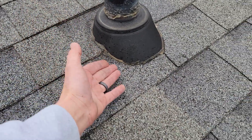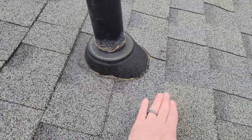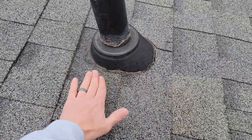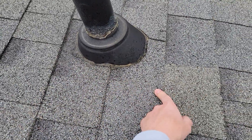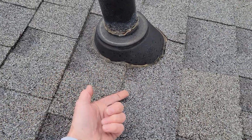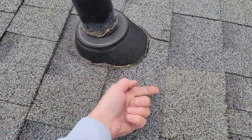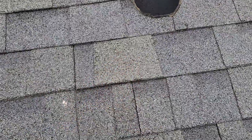So water running downhill is on your pipe boot flashing and whatever is on either side runs out on top of a shingle. You've got to use your own judgment on where you actually break it. If you go under too far, part of your boot is going to be exposed — that's not necessarily the issue — but if it's too much exposed, you risk water going in under the side or catching your nails, which over time rusts out.